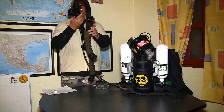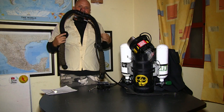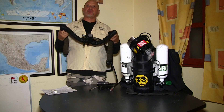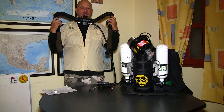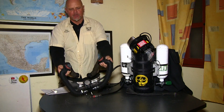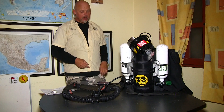I'm going to open up the mouthpiece and close both ends of the loop. When inhaling and exhaling, I should not be able to get a breath in or out — and that shows the mushroom valves are working fine. They're working great. That's a very integral part of finding out how well the mushroom valves are working. If they don't work well, you cannot go diving with a rebreather.